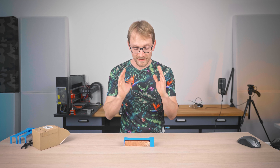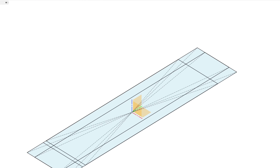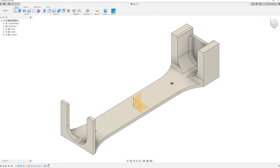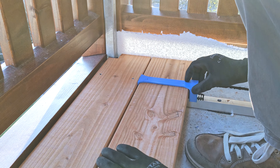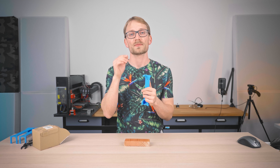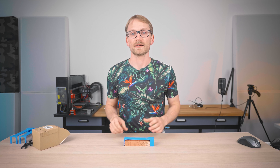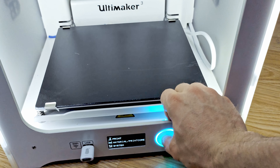It makes me cringe when I see decks that look like an 80-year-old put them down with his toy screwdriver. The design of this part is rather simple — it's three linear extrusions basically in Fusion 360, plus a few bevels and fillets. This is designed to hook over the aluminum substructure at the side where there's already a board in place. I need to slide through that slot in between the boards, so I made very slim fingers that will fit through that gap. On the other side, I've got this chunky part that should be a bit more robust and align itself more easily.